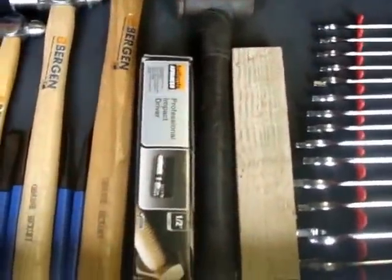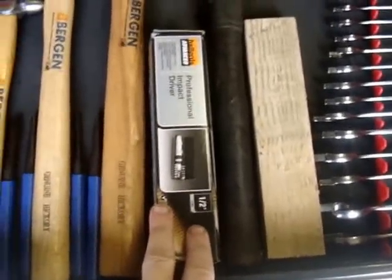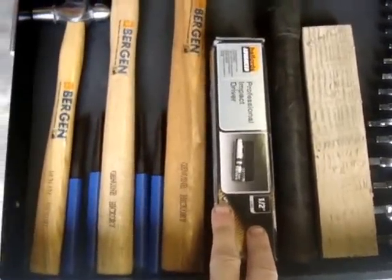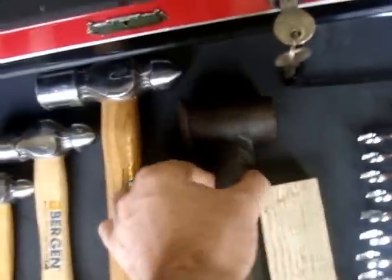I've got my striking bits now — I've got all my hammers and my punches of different sizes. Impact screwdriver, which is really handy — if you can't get a bolt or screw off, you just get the correct bit on and smack it with the hammer. This is my soft compound hammer, which is handy. The other thing I sometimes do if it's something delicate is just put a bit of wood on top of it and hit the wood, to save damaging whatever it is I'm hitting.